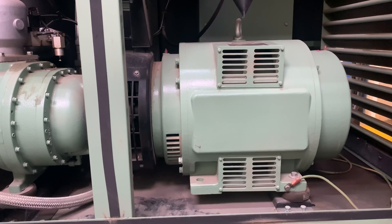The importance of the insulation resistance test is to check the condition of the insulation of the motor winding or the cable that goes to the motor. You can check both the cable and the motor at the same time, and if the reading doesn't look good, you can disconnect the cable and just check the motor windings alone. This way you can tell if it's the cable insulation or the motor winding insulation that is actually breaking down.